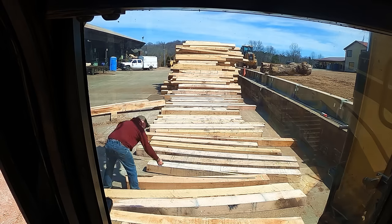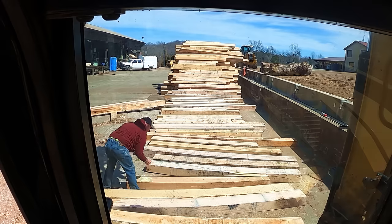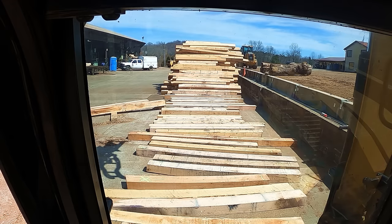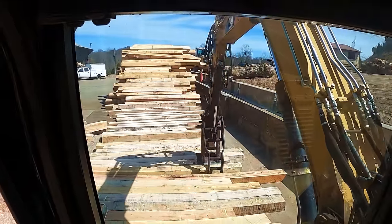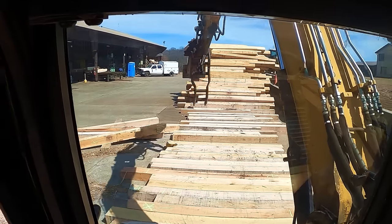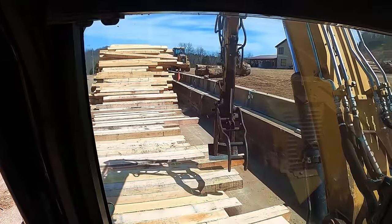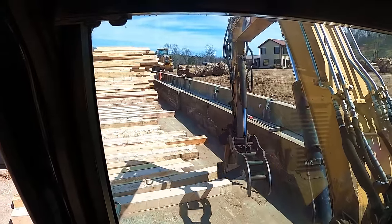And their stipulations are stiffer. I have to be more careful when doing switch ties because you get by with less, because the rail could be anywhere on a switch tie. So they grade them tighter. Whereas on a normal railroad tie, the RBA, or rail bearing area, they're pretty sticklers about, but some of the other parts of the tie are much less so. So you can get by with some things in a regular railroad tie that you can't get by with on a switch tie. So that all goes into the grading.